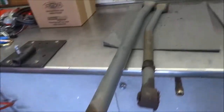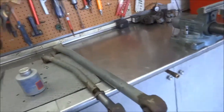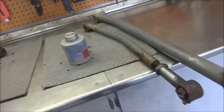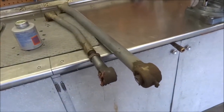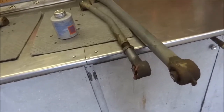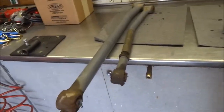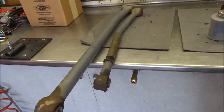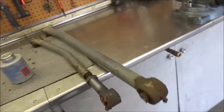We'll see how much better the ride is with the rubber bushings. My son noticed less road vibration when we did his. That's one of the big selling points of rubber versus poly. When I had my old Suburban with a big block I put all poly motor mounts and poly performance suspension mounts in the leaf springs and I could pick up a lot of vibrations — from the engine but also road vibrations. So we're going back to rubber.